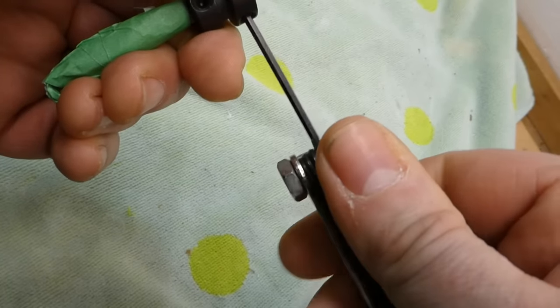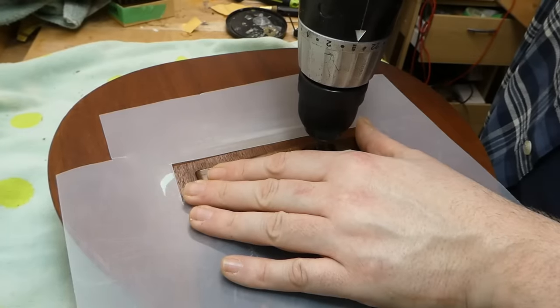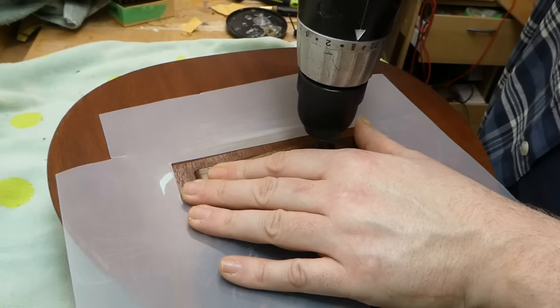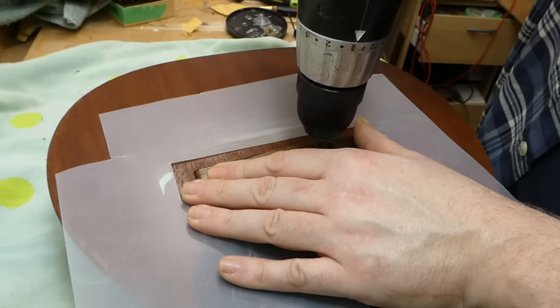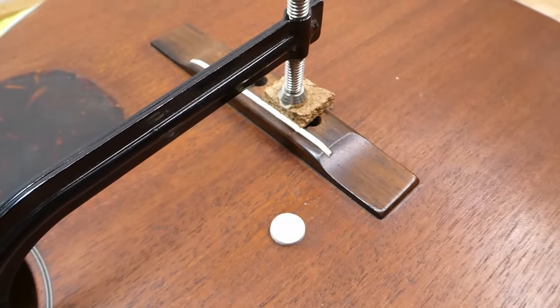To repair the wallowed-out holes in the bridge plate, I'm using my el-cheapo plugging tool made out of an old countersink bit which I reground. The bridge plates on these late-50s guitars were still quite thin, so the plug is only going to be about a sixteenth of an inch thick. In what is a total upending of the natural order, I use the drill in reverse and pull upward to cut a little circular recess into the bridge plate, into which I fit these little maple plugs — glued and clamped, then a light sanding to make them flush.